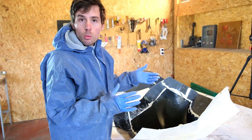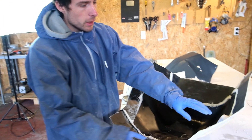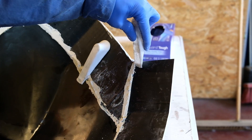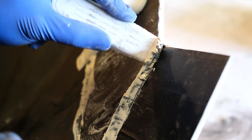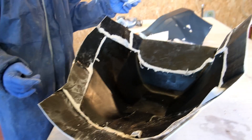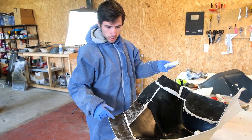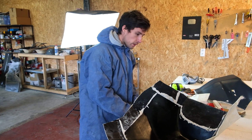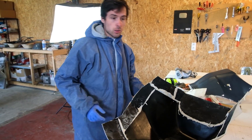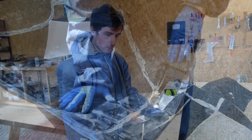Any damage left on the mold — the parts coming out of the mold can be sanded again. We have some sharp edges that need to be a bit more flat, so we can sand those down. This is just the flange area, so we have a lot of flange — the preparation was well done. It's important for easy applying of tacky tape and infusion tubes. Most problems with infusions come from the vacuum bag — if you don't have a fully sealed bag, you cannot do good infusions. But it's just practice. We'll continue cleaning the mold now and then proceed with the layup.